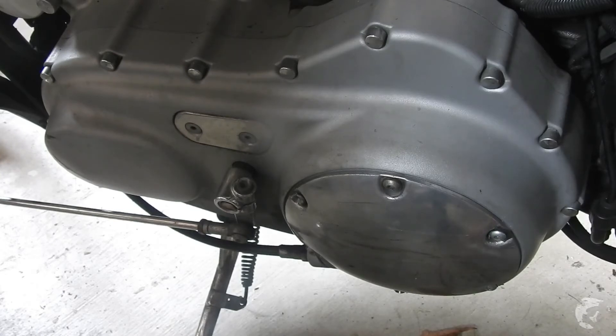The key is what I'm doing is just dipping the drill bit in oil, and I'm using my cordless drill because it goes a bit slower. Apparently you have to go slower with steel, otherwise the drill bits get too hot and they start to go dull. Hopefully getting some better drill bits should make the drilling a bit easier.